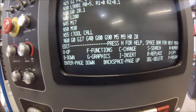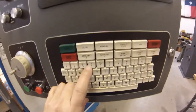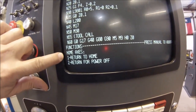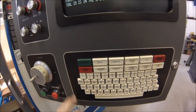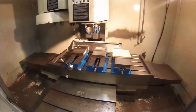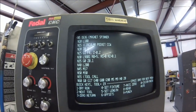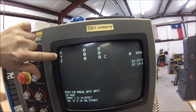The bottom quadrant of your screen will start toggling through different menus: a quick key menu, an edit menu, and a functions menu. In the functions menu, hit number four. It asks whether you want to go home temporarily or for power off — hit one for just for now. Blue light is blinking on top of the machine. Hit start, Z goes up first always, then the table goes back to home. Hit the manual button to see X, Y, and Z zero back on the screen.